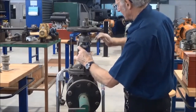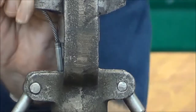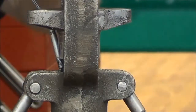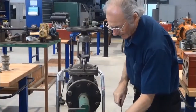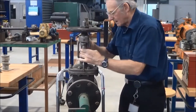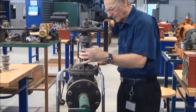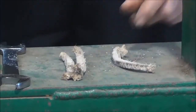This is what we refer to as greasy hemp packing. It is flax or hemp which has been woven like a cord with grease impregnated through the strands. When it is under pressure, the grease gets forced out, which lubricates the packing onto the shaft. It stops it from overheating and scoring or getting too much friction and drying out. The lubrication keeps the packing soft and pliable so that when it is under pressure, it can compress and spread out, forming a seal between both the housing and the valve stem.